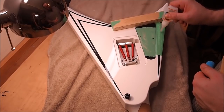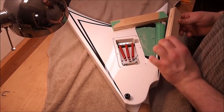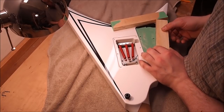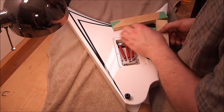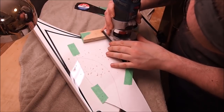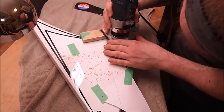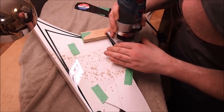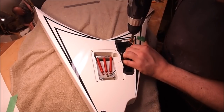Here's a tricky, kind of scary operation. I'm using super glue to stick two pieces of three-quarter inch plywood directly to the surface of the guitar, using the new cover plate as a reference — basically building a template in place. This is not for novices; you have to know your way around a router, have a light touch, know which way to feed the bit. I would never suggest anyone who's not an experienced woodworker do this on someone else's guitar. After that, I'll use a drill and the router again to remove the rest of the waste material.